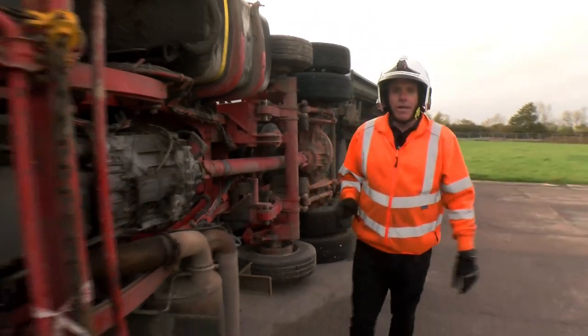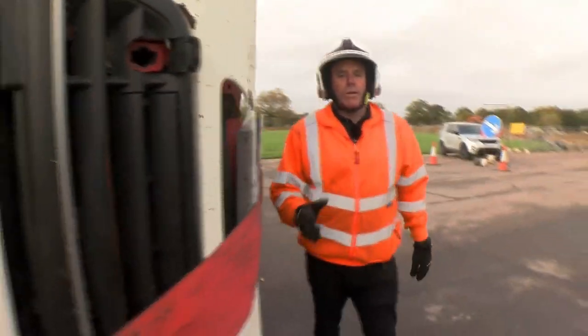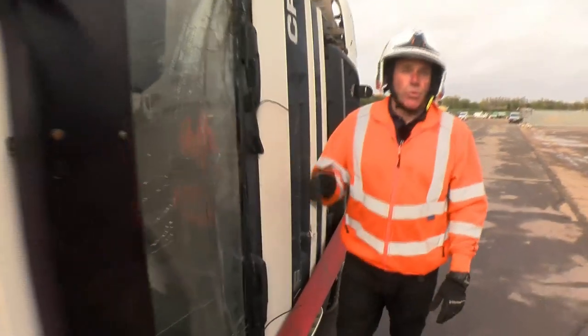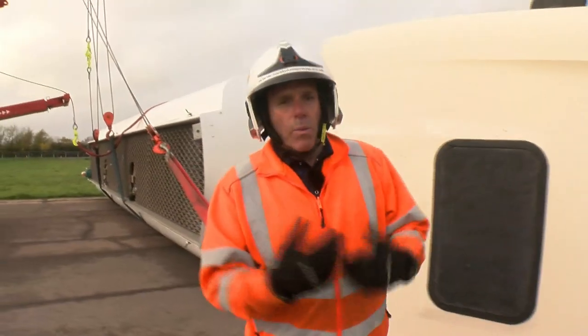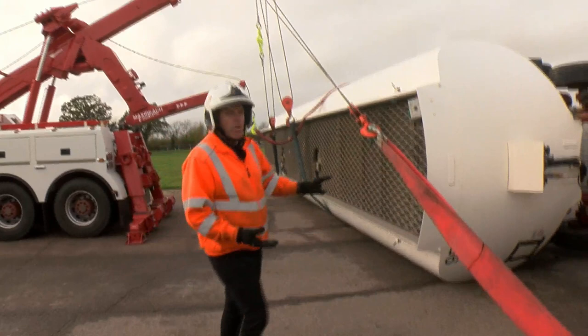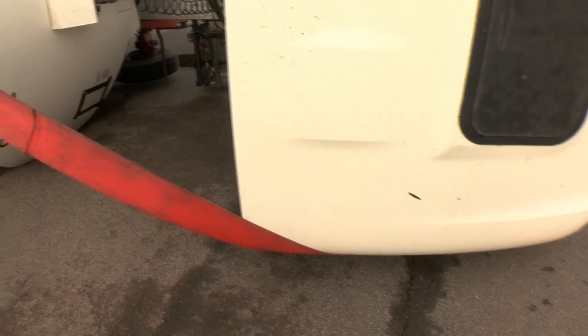Let's go and have a walk around the other side. We can look at the equipment — some changes in equipment. We're looking at top booms with XP legs and extra winches. Where we're looking at these weaker chassis, this will be something you might not have seen before: we've got a strop around the cab coming from an extra winch up on the machine.